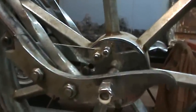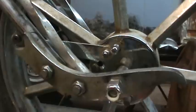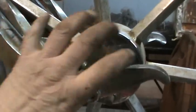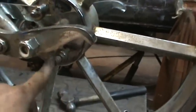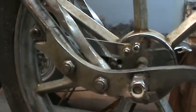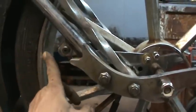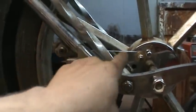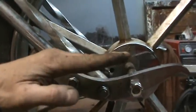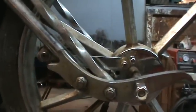I had to do what I had to do because I couldn't leave it the way it was. A couple of things I ended up doing to hopefully cure it — the original hole is there, the new one is here, so I was able to clock the whole thing back further to give me more room around where the lever will be. The top bar was too short, so the piece I cut off I re-welded back on but on an angle, so that arm doesn't want to stay as straight — it has a little bit more of an angle to it.